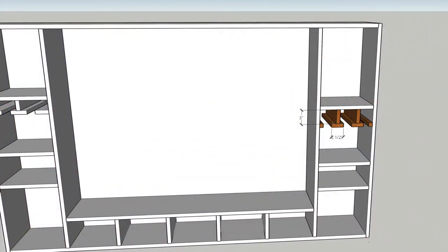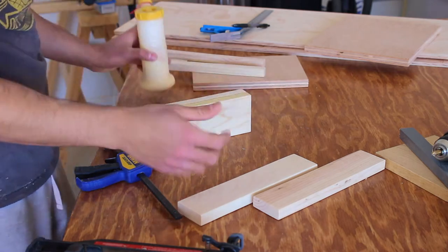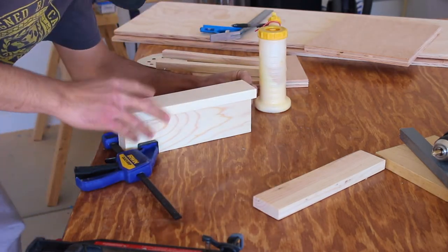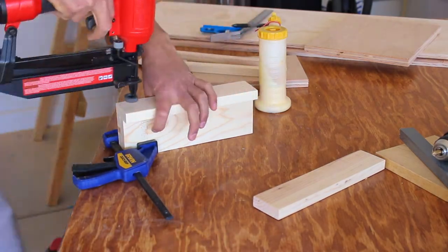After that, I start making the drill holder. Since I only have three drill guns, this spot is custom made for my own needs. This drill holder is very simple — it was made from three-quarter inch scrap wood. It's like a T but upside down. The vertical runs three inches and the horizontal part is two-and-a-half inches, placed right in the middle.